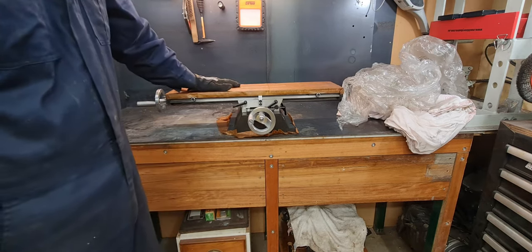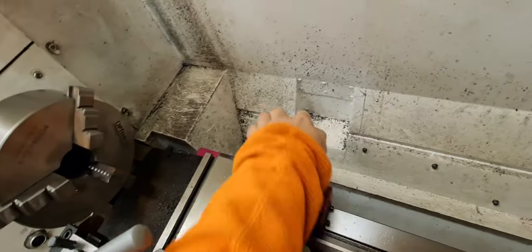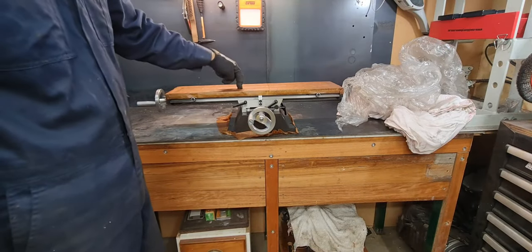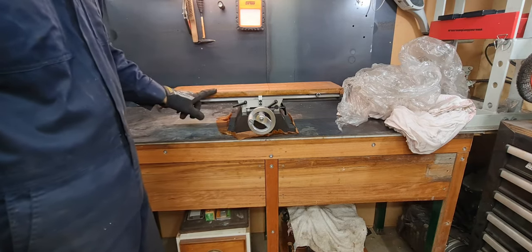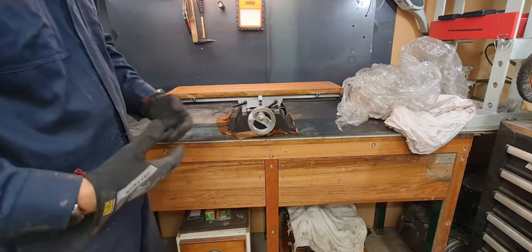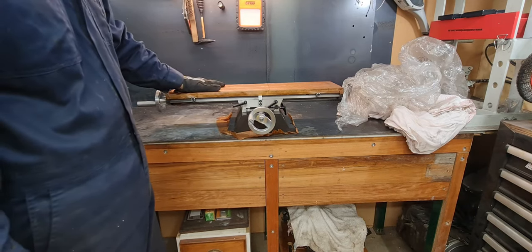It also means it's very difficult to mill something on a lathe because you're limited to the fixtures and fittings you can have on the lathe bed, because there's no T-slots where you can clamp your parts down. To cut a long story short, I thought I'd just take the mill section off the lathe. Then I saw this advertised on eBay for only a hundred bucks, and it looked like an exact copy of what the Optimum lathe and milling company was using. Basically all these hobby lathes and mills are clones of each other, so generally the parts are interchangeable.